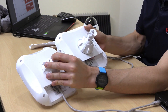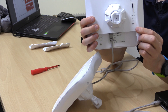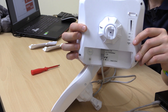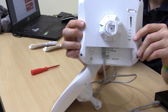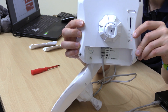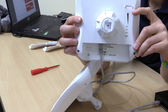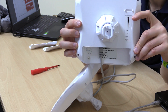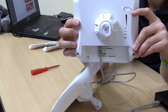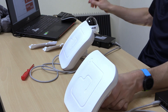Both devices are plugged in and currently booting. On the back we have indicator lights: the first is a power light confirming it's receiving power over Ethernet; the second is WLAN, indicating the wireless LAN is active; then LAN 1 and LAN 2 show physical port network connectivity; and finally signal strength LEDs that light up according to received signal strength for the link. We've already linked up — we have a light indicating the link is up and signal strength is excellent.